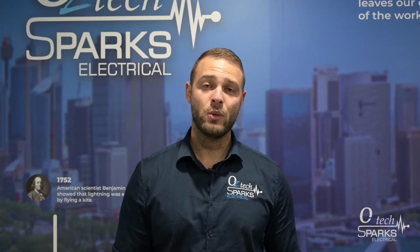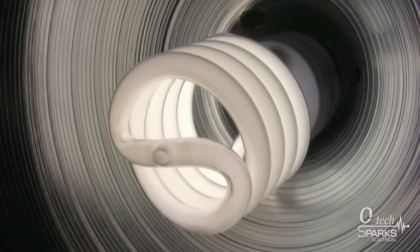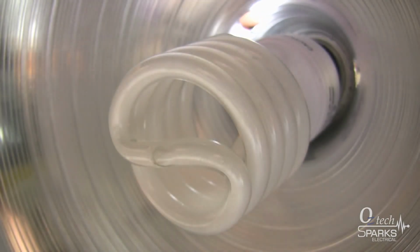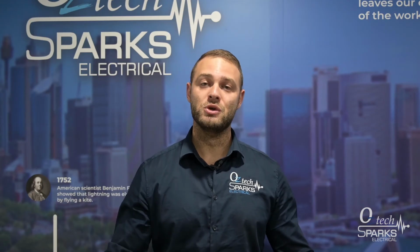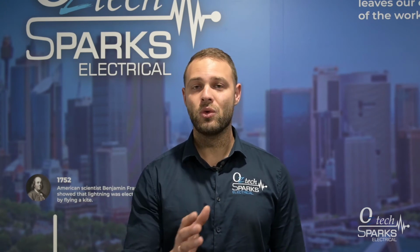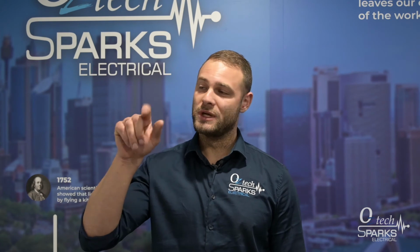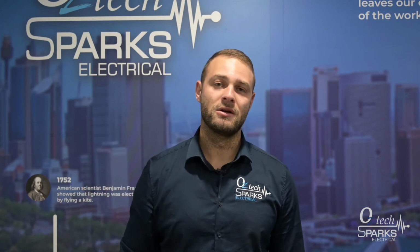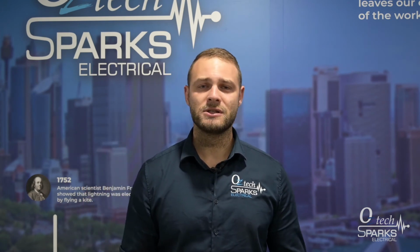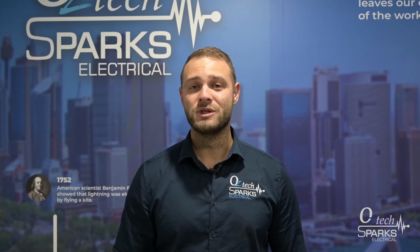For example, if we're going to be working on a light circuit and we're installing new lights or new switches in a house, we're going to go to the switchboard and just flick off the circuit that says lights. That ensures to the customer that we're not coming in the way of them using power at the house at that time. So if in the switchboard all the circuits were labeled power, to us we're just going to be guessing which circuit is the one that's taking care of the lights. And it's just poor effort, it's poor workmanship whenever you see things like that. So correct labeling in a switchboard is a must.